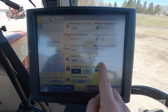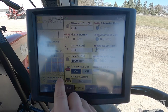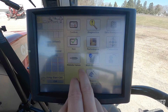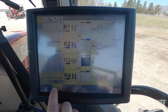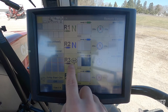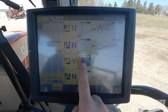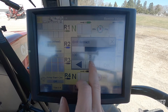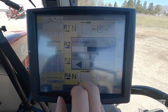Now we can adjust our hydraulic flow going out to this bulk fill a couple of different ways. One way is through the monitor — press the back button, go under remote valves, and on the flows one through four tab at the bottom we see remote three is currently set in motor mode. This is our flow setting. If we press this box, we see that our flow is currently set at 70%. We can take this flow down or increase it right off the monitor.